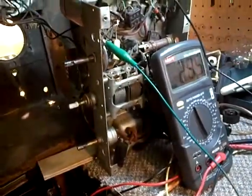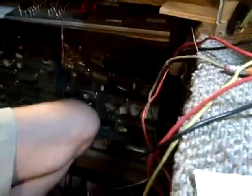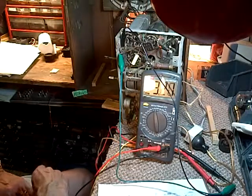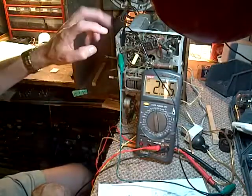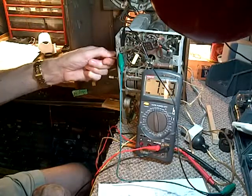Now we're going to look at the circuit. All right, welcome to Jim's Radio Shop. We're continuing with this Canadian General Electric radio with the words Marconi written on the front. We're investigating the volume on this radio which does not appear to work properly, and the way it's wired into the circuit doesn't match the circuit diagram. So what I'm doing currently is figuring out which of the three terminals on the potentiometer for the volume control is the slider. My ohmmeter is connected to the two outside terminals, and as I turn it you can see a change.